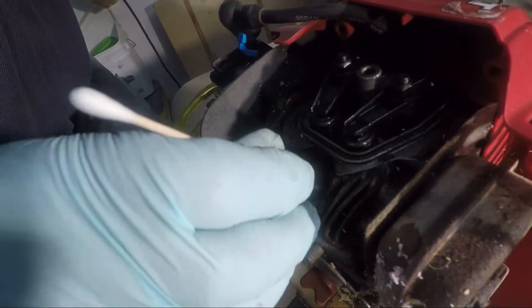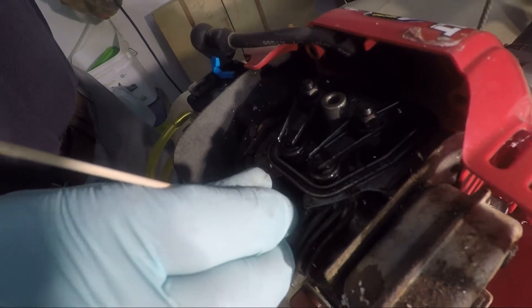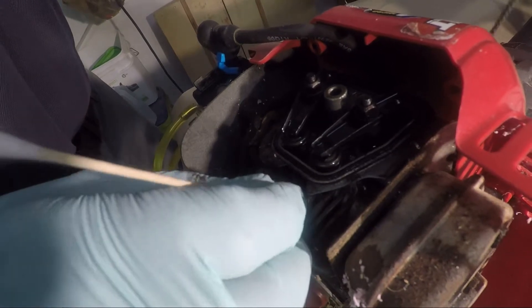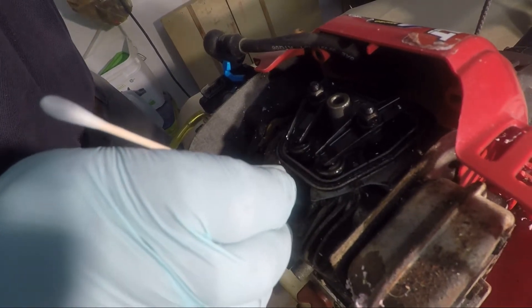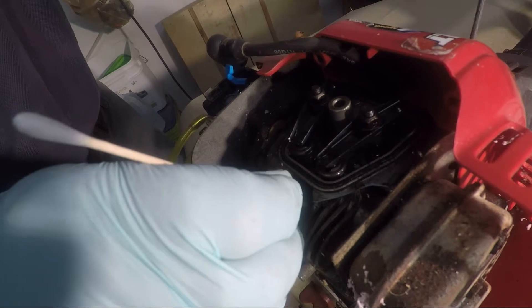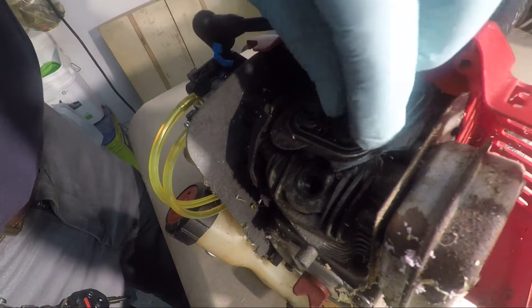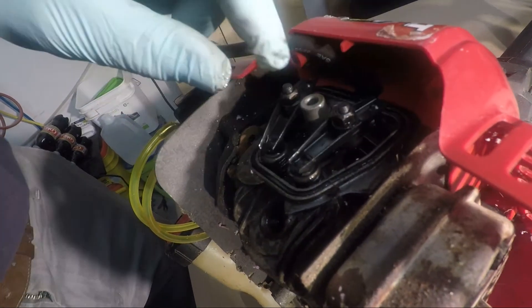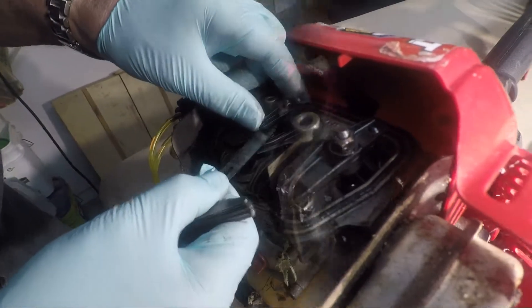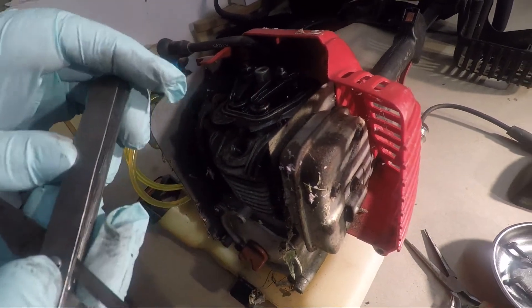So let's go — it's starting to go down and it's coming up, going down. We have some more string here. That one is loose — very loose, very loose. Alright, grab a feeler gauge. It's supposed to be five thousandths and this thing is dancing around as you can tell. Let's see what it is.